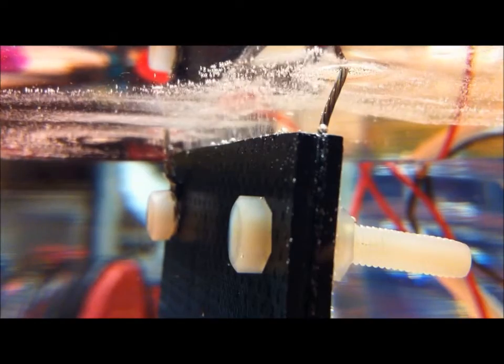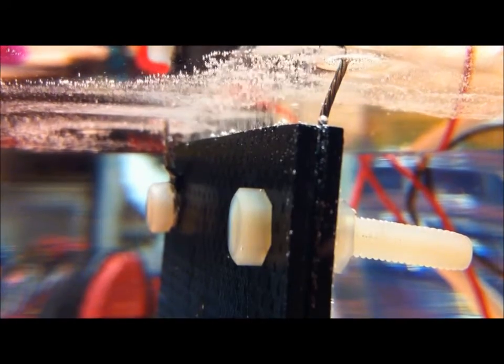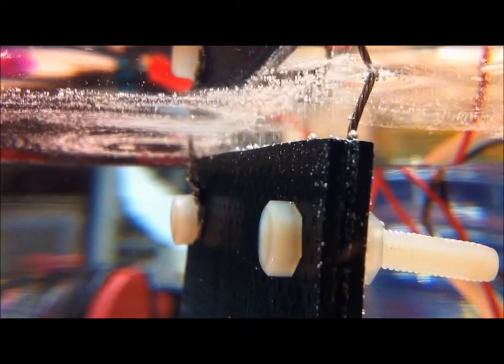I have actually put these plates under load at 15,000 volts. Haven't quite hit 20 yet, but I've put them under 15,000 volts AC at line frequency through a neon sign transformer. They held up well. I just connected one wire from the transformer to the plate, and on the other end of the plate, straight to the load, and it carried the load quite well. Didn't mark the surface, no deterioration of the plate, still just as strong as a standard carbon fibre plate, sheet, whatever you want to call it.